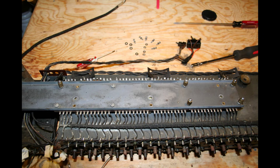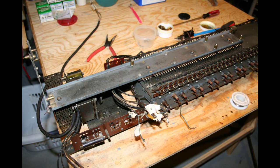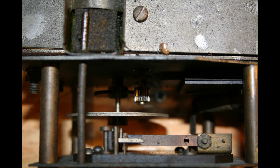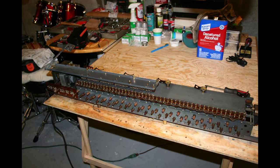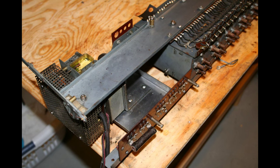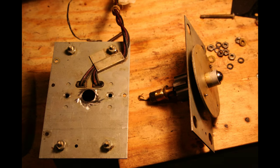The chorus generator had a bad run motor. And that presented a bit of a problem because these pre-scanner vibrato run motors have a different gear in the middle. We had to go in search of another run motor that would work, either from a Model A or preferably a BC that used the same cage-style tremulant. Again, Joe Pantano and Tim Warnick from Retrolinear to the rescue, they found me a donor run motor, but Organ Forum member Microlevel was great, and he sent me a little tutorial on how to do a gear swap.